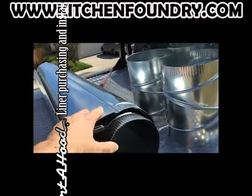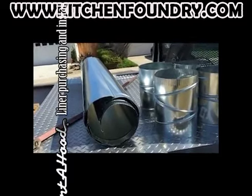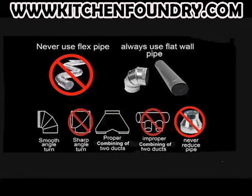As with any ventilation hood, this will have an impact on the exhausting air. It'll give you a loss of suction. So we want to follow the pipe diameter for this particular hood we're installing today. That is 8-inch diameter round. And if we are combining multiple air streams on a 3 or 4 blower hood, we use the manufacturer's production transition to properly combine those air streams.